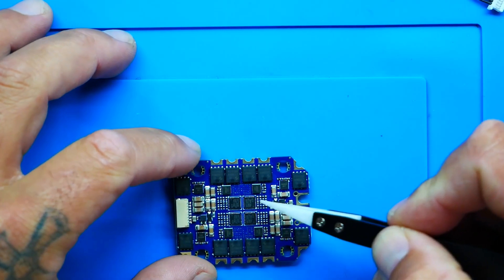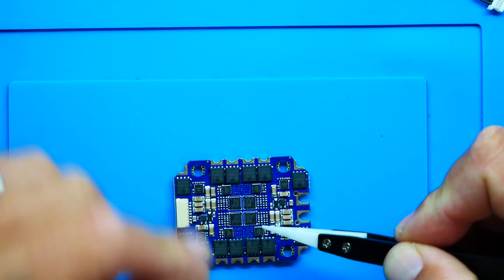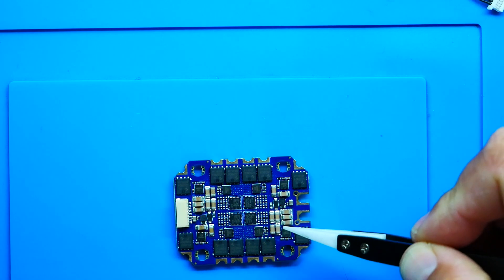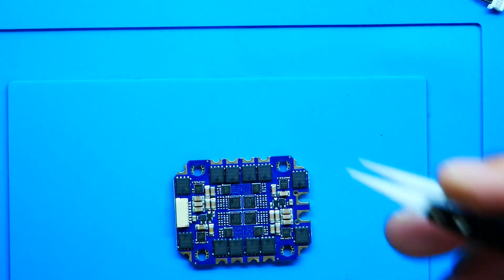If we flip this puppy over, you can see in our MCUs we're running STM32G0s at 64 megahertz. We're running 128 kilohertz motor PWM signal and that is full sine wave — faster, smoother, and all-around better quality signal. And that is going to feed and feel and run nicely on these motors. I love it and I am excited about it.